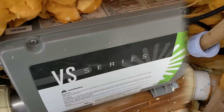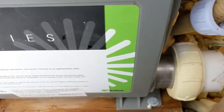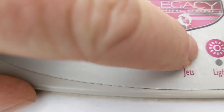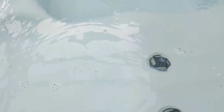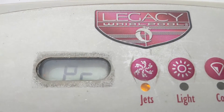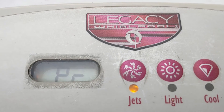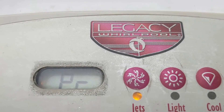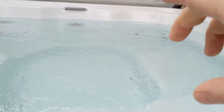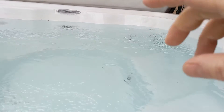We're going to start it. We've got it on — I think we've got an airlock. We're going to put it on high speed to get the airlock off. There we go. If you turn it on sometimes you get an airlock; just purge it at the beginning when you first put fresh water in. PR is not an error code, it's just purge in the system — it'll go away once it gets up to heat. Reset your temperature. If this video helped you out, hit the like button below, subscribe, and we'll see you on the next one.